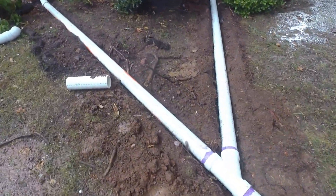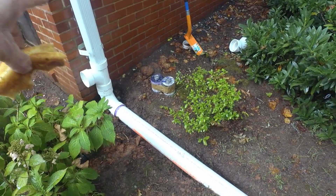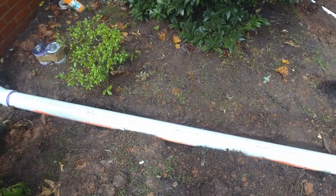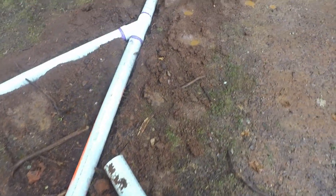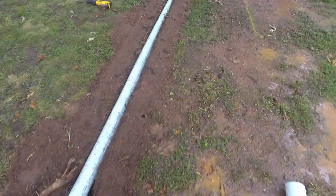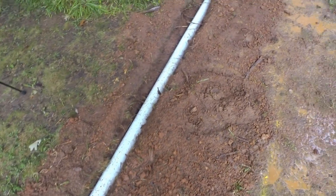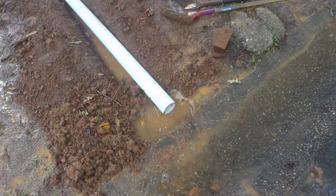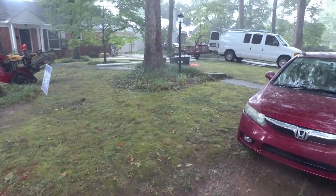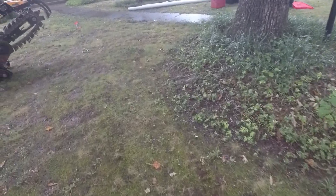Everything's got good fall on it. We're in a fairly level yard here so we didn't have a lot of fall to work with, so we ended up coming higher on one side - that's one way to achieve fall. I'll get some YouTubers on my channel saying the pipe's not installed correctly. What do I consider correctly? I consider a pipe installed correctly when my level says it's got fall and during a rainstorm the pipe is gushing. You can see how flat this area is - the homeowner said all other considerations are irrelevant compared to getting this piping in here right.